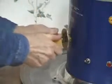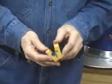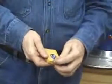The rubber mold is supported by aluminum plates. It is grasped firmly and held against the nozzle of the wax injector to make a good seal for 2 to 3 seconds. The wax is allowed to solidify for about 10 seconds before the wax model can be carefully removed.